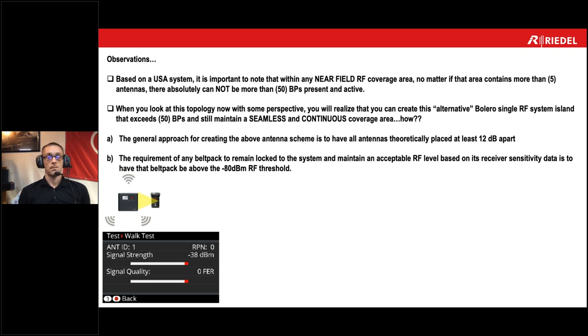Ike Zimbel asked an obvious question. If you're in an area that has other DECT systems operating, how does the system react and how do you deal with that? Like maybe FreeSpeak or Romeo in the same space. Yeah, that's actually covered in some upcoming slides, but the short answer is that they can coexist. Because our belt packs are registered uniquely to our system and their belt packs are registered uniquely to their own system, and our system encrypts the audio transmission, there's really no danger of audibly interfering and breaking into another system. Because they're both DECT-based, they're both based off the same theory, and although they use different codecs, the commonality of both being DECT means that inadvertently you could have a belt pack from our system occupy the time slot space on their system.